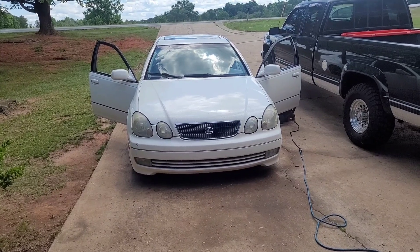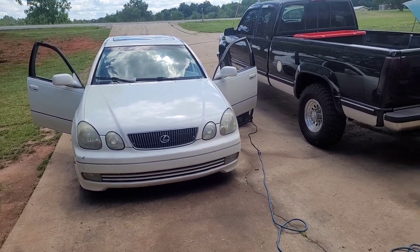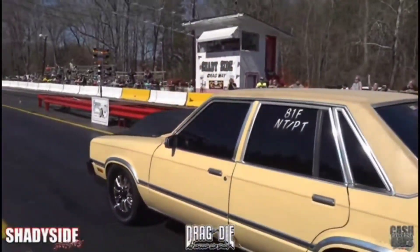It's been killing me sitting at 46K subscribers — was at 500 one time, that sucked. But it is what it is, I ain't gonna complain, I'm gonna carry on. For the next video, we're going to try and see if we can give this old Danger Ranger a tune-up. First thing we're gonna do is put a pair of coil packs on it and see if it acts any better. We already did plugs on it on the primary side, so that should help some. I think it's got a lot of fuel issues, but I'm not in a position to mess with that today — just gonna put the coil packs on and see if we can get any better.